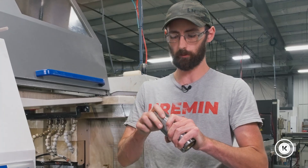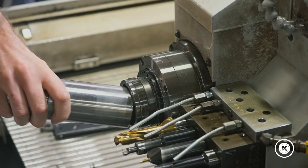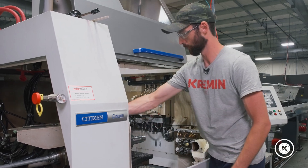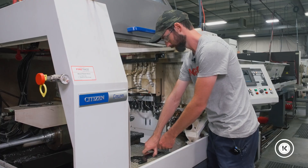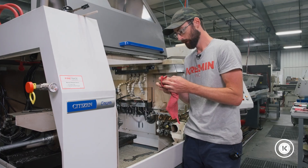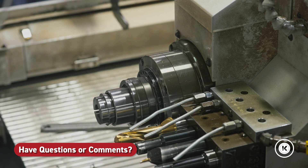We're going to put this in there just like normal — it just slips in, slides freely. We're going to put this assembly back into our spindle bore just like we would on a normal setup. Get her lined up, give her a little persuasion to get her started. Line up your dowel pins. Give your spindle nut one more wipe for good measure. Make sure your contact surfaces are clean. We'll go ahead and put this all back together.